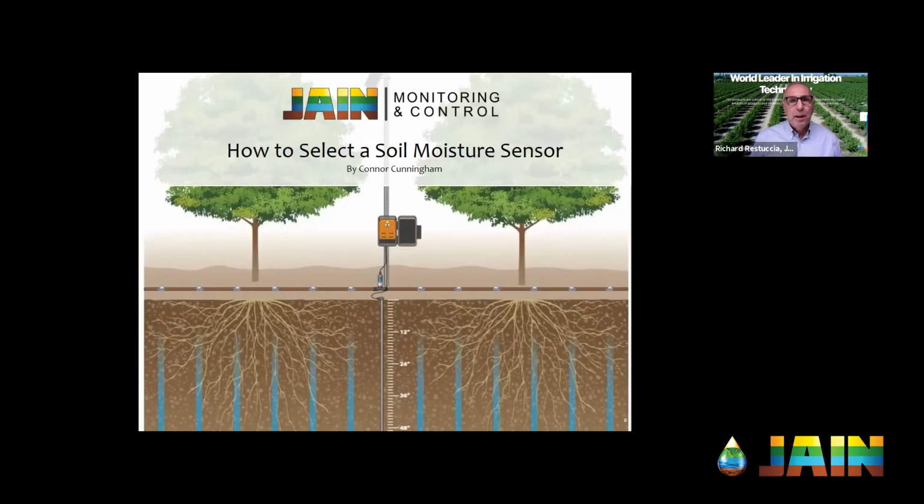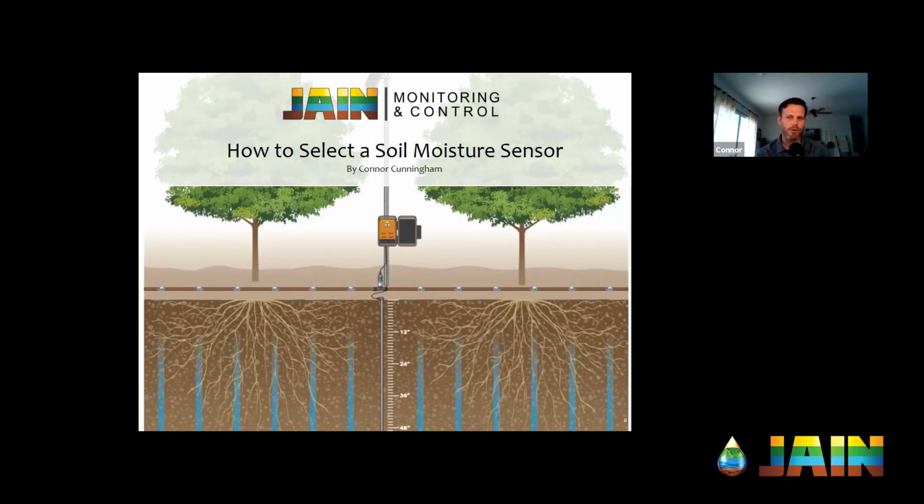So, okay. The gypsum block, a viable solution to soil moisture, maybe a little bit more than the tensiometer. And these data loggers, can I see and record and say, okay, today my soil moisture is this, tomorrow, will it keep a record of that so I can go back and look? It depends on the data logger that you're using. The $300 unit that I referenced is a handheld data logger, and it has little alligator clips on the end of it. So you'd actually have to physically visit the site, clip those little leads onto the wire sticking out of the ground, and then collect your reading. So it's still requiring you to visit the actual soil moisture probe site to get the readings off of it.